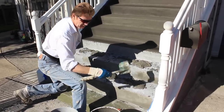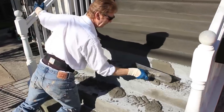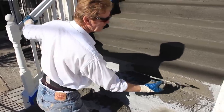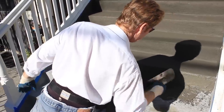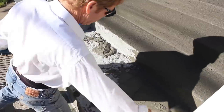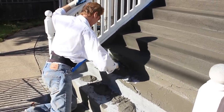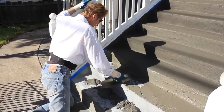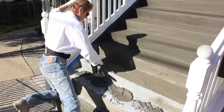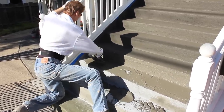You scoop it out of the acrylic bucket. There are about 20 different acrylic finish materials — I've used them all. What I'm going to use first is this big old trowel here to get my top coat on. If you're afraid of getting dirty, don't use this stuff, because it sticks to everything — it is messy, messy material. Most materials that are really good are kind of a drag to clean up. This is not water clean-up. I've already done the top steps so we're just going to get this on, then float it — meaning we'll give it a sandy finish.